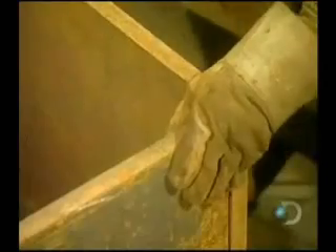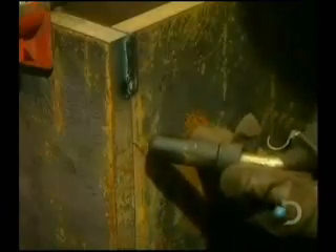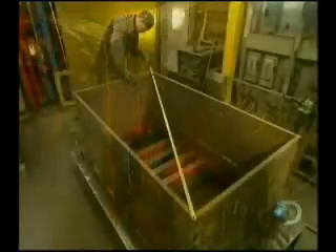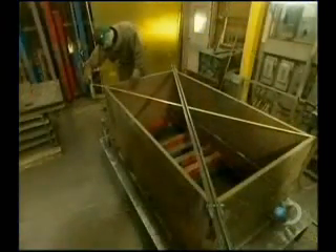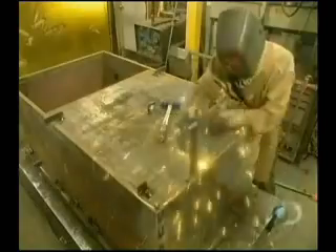It's finally time to put all the components together. They construct the frame in an assembly jig, then insert the plates for the sides, top and bottom. Using the MIG welder again, they fuse the pieces together. They measure the angles, then use a giant clamp to square the safe. Finally, they install the plate for the back of the safe and weld the joints.